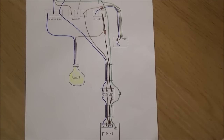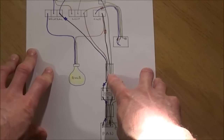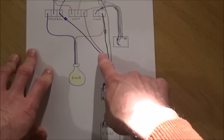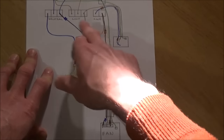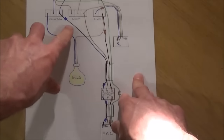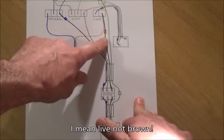In order to make your connection to your extractor fan, you're going to need a length of three core and earth cable. This has three sheathed cables and one bare cable — the bare one being your earth. You'll usually have a black cable which you can use for anything, a brown cable which you use for your permanent live, and a grey cable which you can also use for anything. Whenever you're using these different colour cables as a live or a neutral, always put a piece of coloured tape over the end to indicate what they are. On the grey one, which is neutral, put blue tape; if it's brown, put brown tape to indicate it's a live terminal.